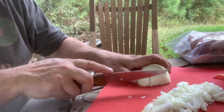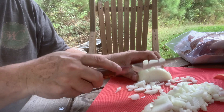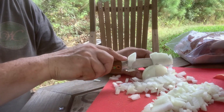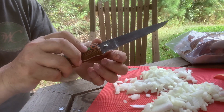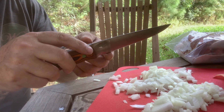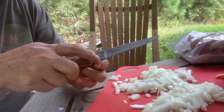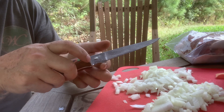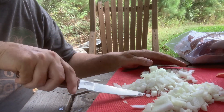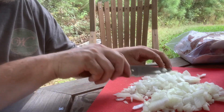We'll get some feedback from Great Northern Knives anyway. Somebody said that they wanted a blade where it should have been dropped a little bit so they could do kitchen chores, but the way that the blade is angled it does this very well as you can see. What I did on Bee was I wanted a tooth right there because when you're filleting fish or cutting through bone, you want a strong reinforced point to cut through those very tough hides on catfish and salmon and a lot of the saltwater stuff. So I did as small a place as possible and yet still sharpened it and put a tooth there so that it's going to be a better fillet knife. As you can see it still has quite a bit of flex to it. I did the woodsman's full flat grind on it.